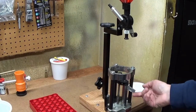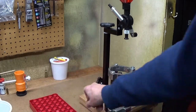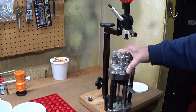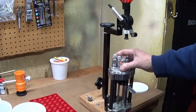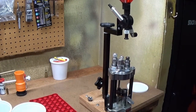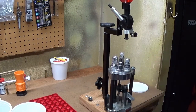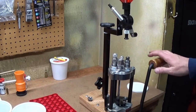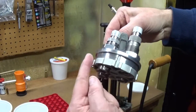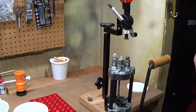I'm going to take my shell holder and put that right there for now, and then this turret is going to go in just like the last one came out — kind of line the notches up, give a little jiggle if you need to. You can get under here and move it slightly, but once it locks into place you should be able to cycle it. I check the cycling all the way around just one time to make sure it's not binding. If I need to, I take a little bit of lube — motor oil is what I use — and wipe it right along this edge right here.